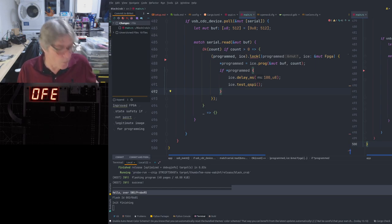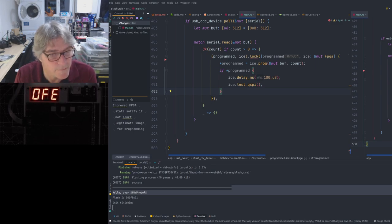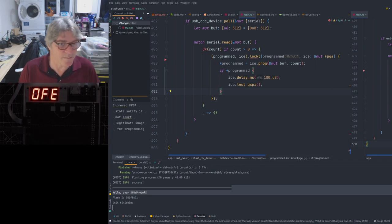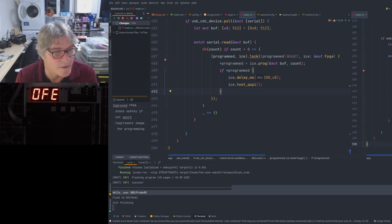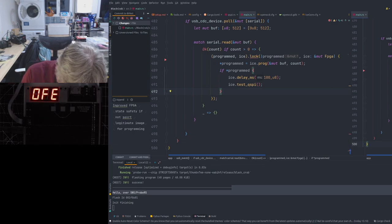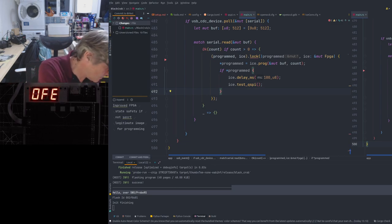One reason that you might want the FPGA to handle some of the Ethernet framing, rather than directly have the microcontroller do it, is you can have the FPGA do all sorts of filtering, for example, so that it doesn't bother the microcontroller unless it's a conversation that it's really interested in. Because they can become interrupt heavy if you're not careful, if you put it onto a network that has quite a lot of traffic, for example.